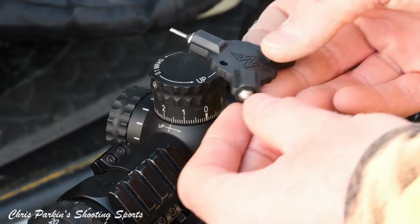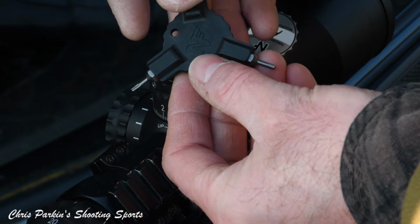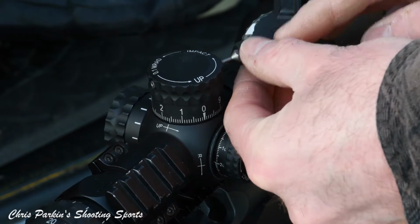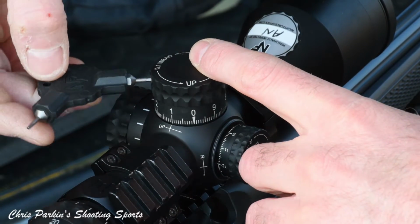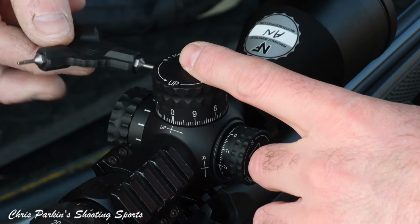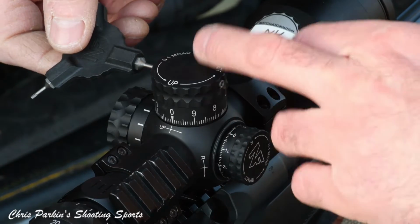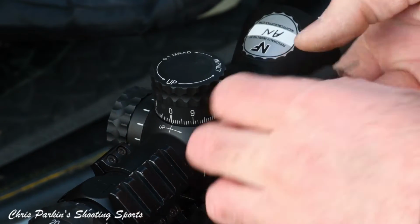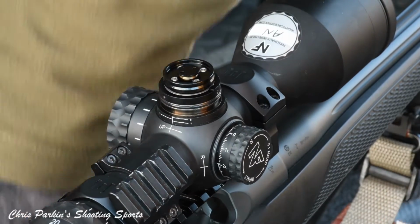Once you've zeroed the rifle, Nightforce supply this small triangular Allen key and torque set for setting up the turrets. So, starting with the elevation turret, we slacken off the 2 small opposing Allen screws there, and we can turn that back to indicate zero and then tighten them up. But there is also underneath here a clutch setup to allow us to set the zero stop. So if I completely slacken those off and lift this turret away, we can take that clear.